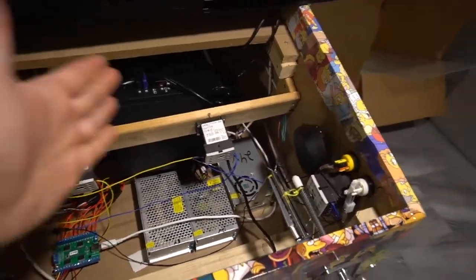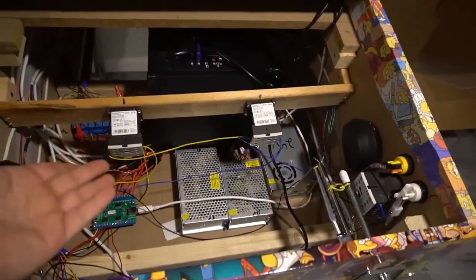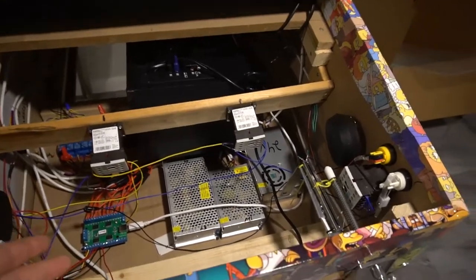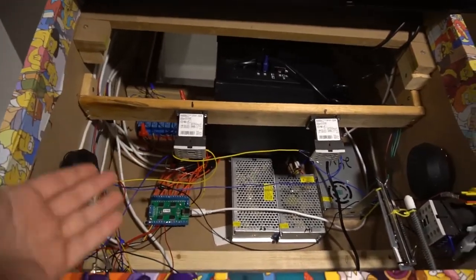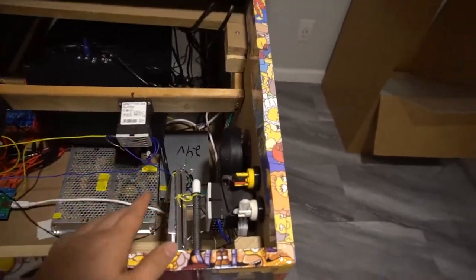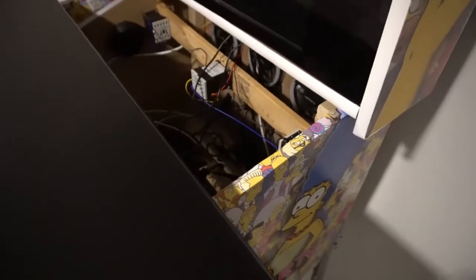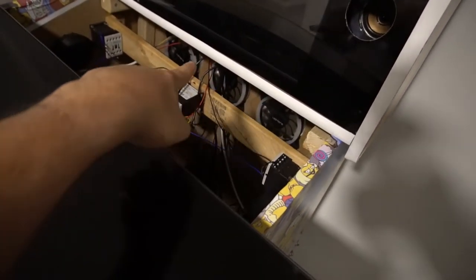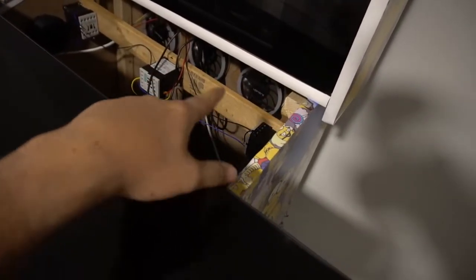The 24-volt powers only the solenoids. I went higher on the amperages because we have a lot of toys linked to this — if you go low, it might affect how solenoids fire. Lower power means less power going through to the solenoid and it might not give you a great effect. So: 24 volts, 12 volts, 5 volts. In the rear of the cabinet I have three fans hooked right up to the PC — they spin in air from outside whenever the PC is on.